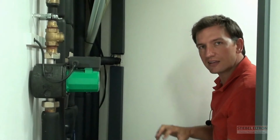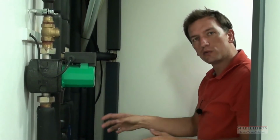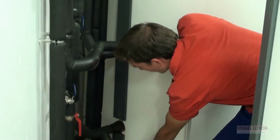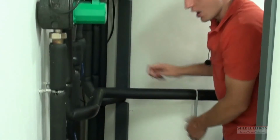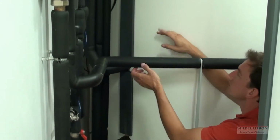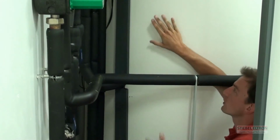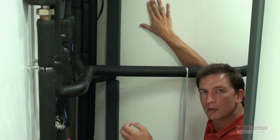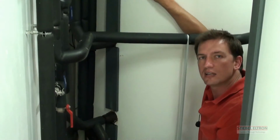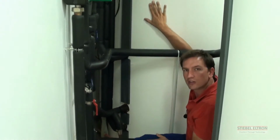Now with this automatic layering of water, the system automatically sorts itself, and these two systems marry. If the sun is shining, it's going to heat up the cold municipal water that comes in the bottom of the tank. Once this section has been heated up, it will automatically rise to the next section with the heat pump. But if hot water rises from the bottom and gets up to the section of the heat pump, it will sense that the solar has already heated the water. So you won't use any additional electricity from the heat pump to contribute to the final energy inside the tank.